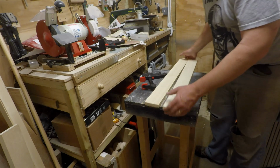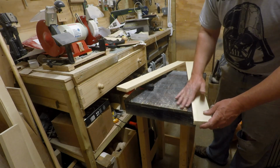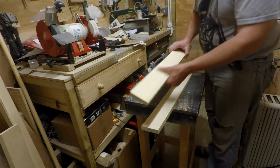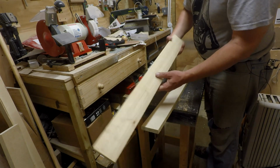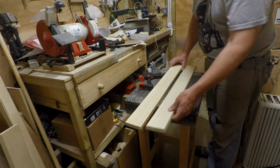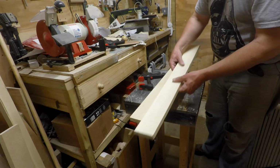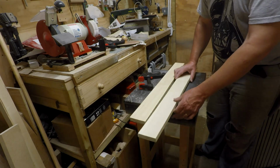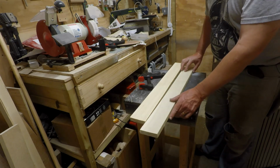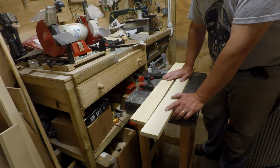Now, of course, I said I don't expect it to gather up all the dust, but what it's left there is pretty minimal. And I've got to say, the result on there, and I know it's only pallet wood, but when you consider that one looks like it's got all saw marks, which was on this side, and this one is one of those ones which gets really all these fuzzies in it, and it's actually come up with a nice finish. If I got the extra grits, I could go over these. As I say, it's only 80 grit, go over a 120 or 240 grit, and these are going to be coming up really super smooth.